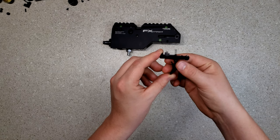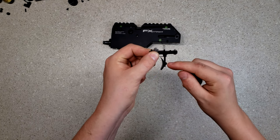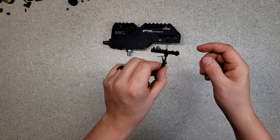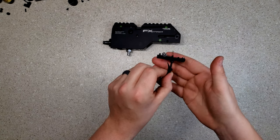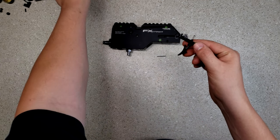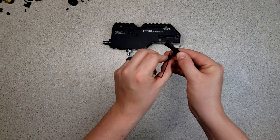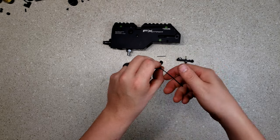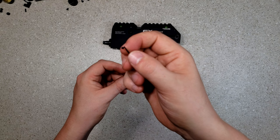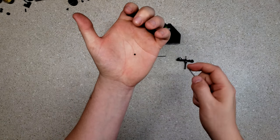As you can see here for the trigger assembly, there's 1, 2, 3, 4, 5, 6, 7 screws for the trigger assembly. So this is probably the most fastener intensive place of the rifle. To start off with, we can use a 1.27. Remove the trigger shoe. Once it's loose, it'll come right off. And it's that little tiny screw. Very hard to see. Little tiny thing.